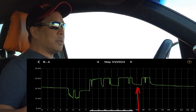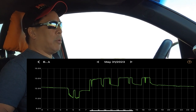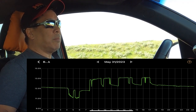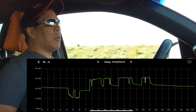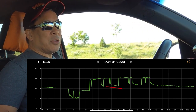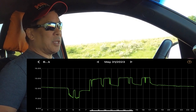The valleys are when I'm stopped — that would be lunch, rest stops, etc., and overnight. I have been using minimal power, even overnight, because the evenings have been so warm. What you should see in these valleys is that the power remains steady, but it doesn't. It's been decreasing over time, and that means that I'm losing charge in the battery for some reason.